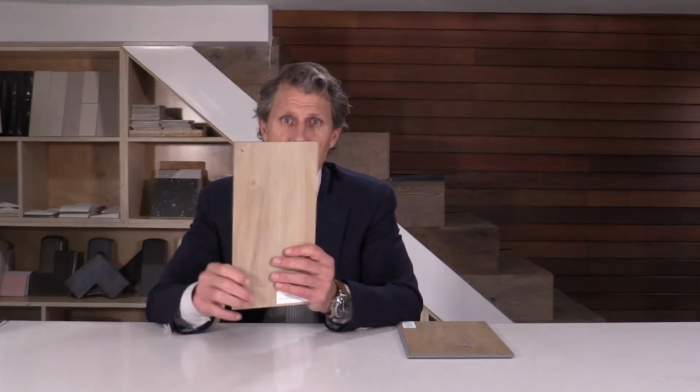It's very important that you use the right notched trowel for the installation of this product. And vinyl is prone to thermal expansion. So anytime there's significant heat or light fluctuations in a room that causes heat changes, the product's going to expand and it's going to contract. If this isn't adequately bonded to the floor, it's going to lift, it's going to pop, it's going to move.